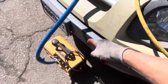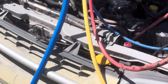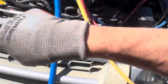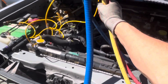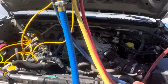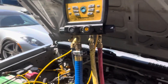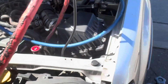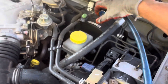I've got the vacuum pump on because every time I use my gauges I always vacuum out and clean them. I'll vacuum these down — they just had dry nitrogen go through them in a positive pressure in one direction and it all came out. They were vacuumed down to 800 microns prior to me getting here, from five minutes away from my last job. I'm about to turn on the vacuum right now and vacuum them down below 100 microns to get ready to go over to the next job right up the street.